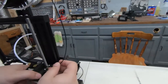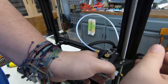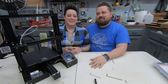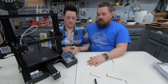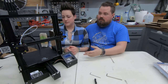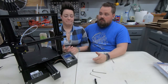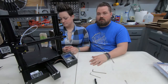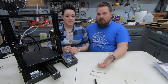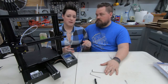Get the filament back on and push it back in the tube. The scraper slides right into the slot, so now we always know where it is and don't have to dig it out of a bag. That's our first round of upgrades — some for cleanliness to keep the circuit board clean and keep things from falling into the V-grooves, some for convenience with the scraper holder, and one for long-term performance on the Z-axis so we don't bend that rod. If you know of any upgrades we should do, let us know below in the comments and we'll see you next time!